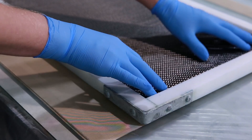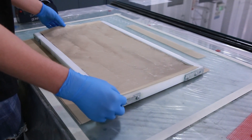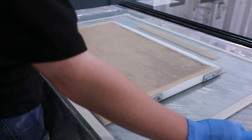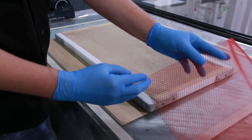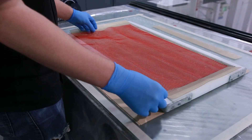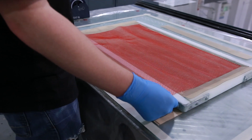After the fabric is laid down, the technician covers it with a layer of peel ply, a fabric that helps distribute vacuum pressure and creates a bondable surface without sanding after the resin has cured. Next, the technician lays down a flow media which facilitates resin flow under the pressure of the vacuum, wetting out the fibers.